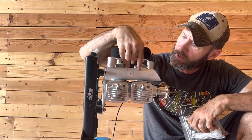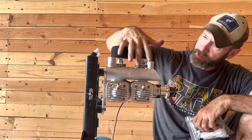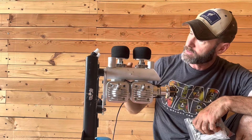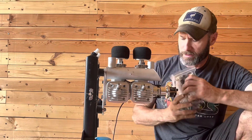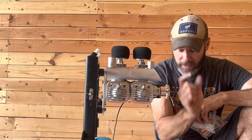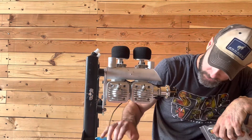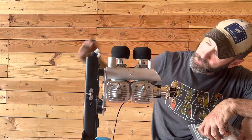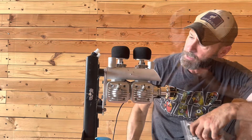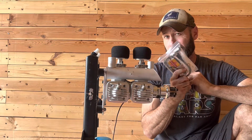Spark plugs are in here and we've got this exhaust in. We're waiting on the same type of three-hole exhaust to replace this four-hole. I'm also waiting on a T-fitting for the fuel line — because we have two carburetors, we need two fuel lines and a split. Once that T comes in, I'm going to go ahead and install the ignition.